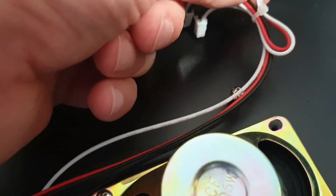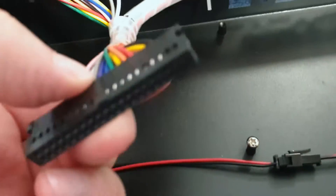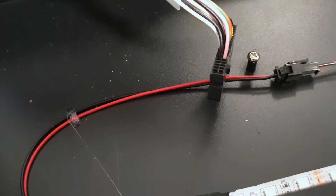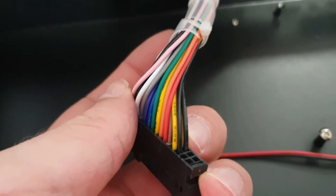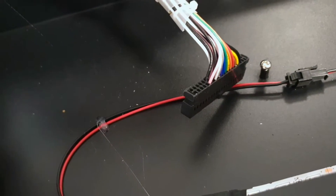I can set up the power switch here as well - it has a nice connector I can clip out and pop the power switch into. My idea is to use this connector and put it on top of the Raspberry Pi's GPIO after placing all the cables in the correct slots. Looking at the common ground, I may have to solder the grounds together, as the ground on the left side and the ground on the right side appear to be two separate grounds. There are multiple grounds on the GPIO so it should be easy to put them into two different ground pins.